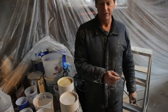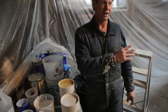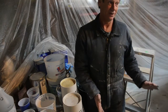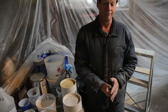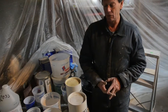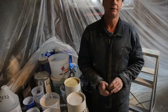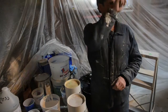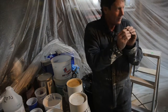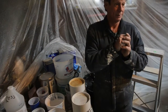I saw where it looks like it's resin rich. Right, so you have a lot of resin pockets and then voids behind it. So you have to determine how much of that you're going to sand off. You don't want to touch your fibers. That's the biggest thing. But those areas where the peel ply didn't touch, you've got to get all that shine out of there. That's where all your blush is. Seeing all the mountains and valleys. That piece in the back where you have that funny little void, you're going to have to get in there delicately and try to clean that up and fill it.